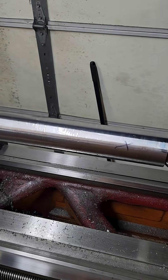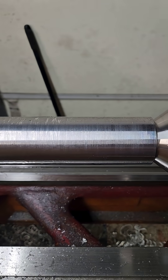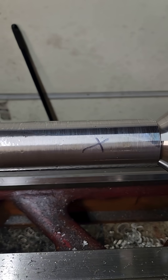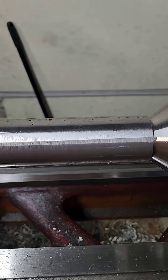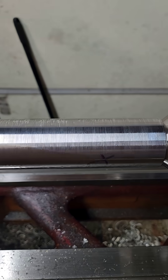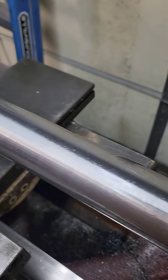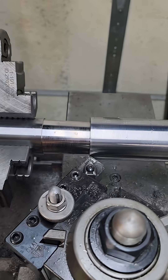This is a chrome-lined and honed barrel for an injection molding machine. The inner diameter is perfect, but the outer diameter has heavy and thin areas — as you can tell where it's cut and then not cut. It's thick and thin, so it needs to be turned until it's uniform.